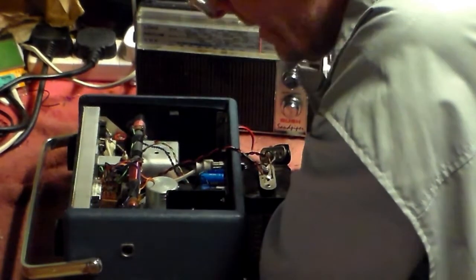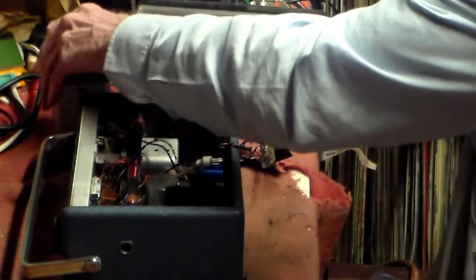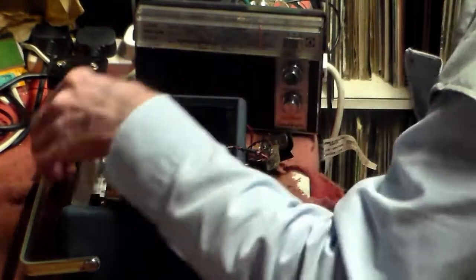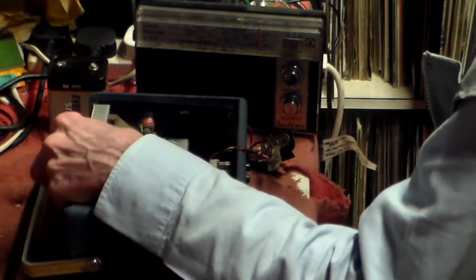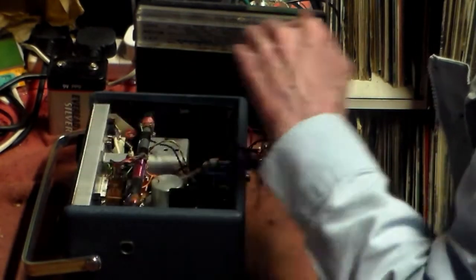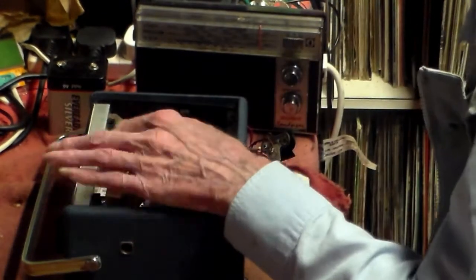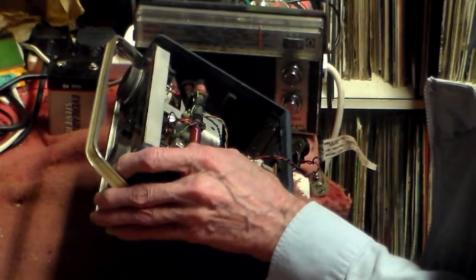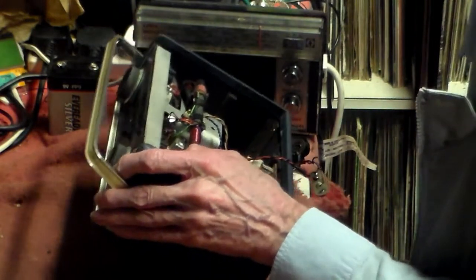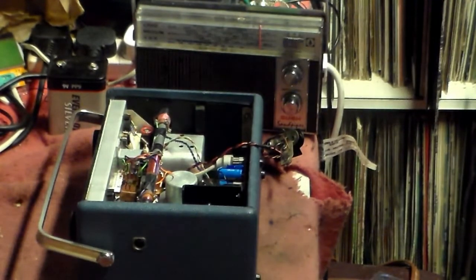Look there. Right, now in these sort of situations, it's usually either, like I said, switches that need to be oiled and greased, which is possible, but in this case very unlikely. Or the other thing is, of course, something has gone open circuit, like a capacitor, or more likely it's been fiddled with. It does happen a lot, so a good look at the pots and stuff can tell you if this radio has been, shall we say, mucked about with, which again does happen.